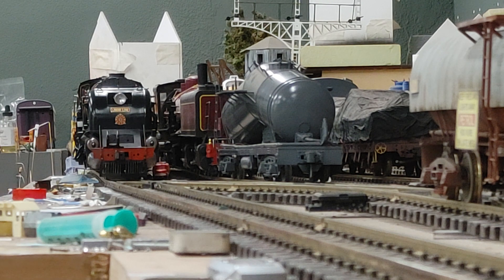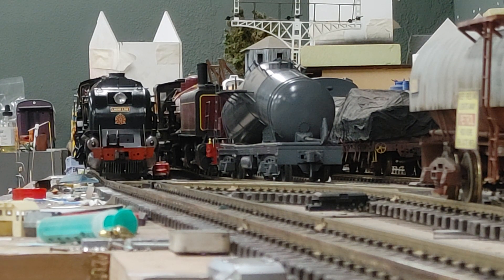Before we go, you must understand that a steam loco when it stands stationary, there's a lot of condensation, so water actually accumulates in the pistons, which is not good for it. So when they move out of the station, normally they open the drain cocks, and the loco will actually move but there will be no chuff, and there will be a lot of steam coming out.